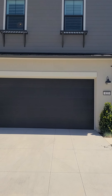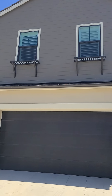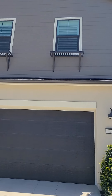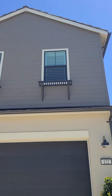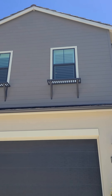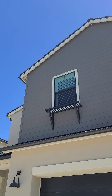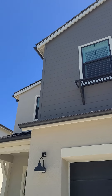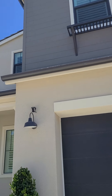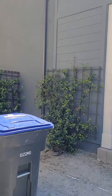We're here at 122 Spur with a home inspection review and everything on the home looks in really good shape. As you'd expect with fairly new construction, there are no major issues at all. The exterior looks in really good shape — stucco looks good, most of the siding is either cement fiber, a very resilient product, or wood trim, all in good shape. The tile roof is in good shape with no broken tiles that we can see, no signs of any leaks in the attic. Above the front porch and garage is a metal panel roof, which is also a very bulletproof system.